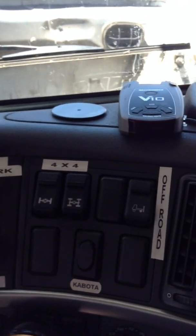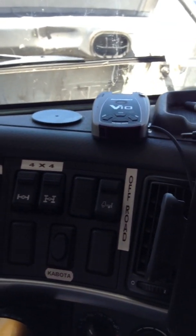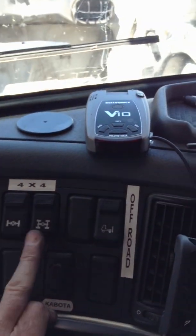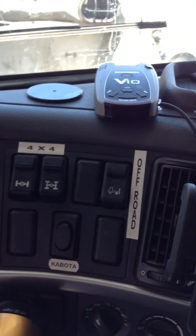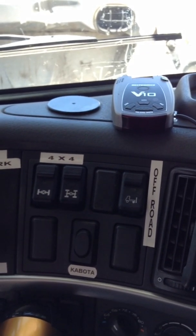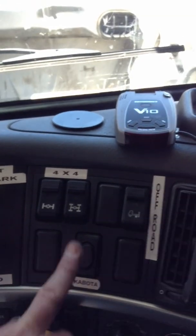This truck is equipped with both a differential lock and full locking rear axle. There's also a bunch of stuff labeled up here on the visor — especially pay attention to how to operate the transmission. The differential lock is a normal differential lock like any class 8 tractor has. You can engage that on the roll. You'll want to slow down to maybe 45 miles an hour and make sure that you absolutely are not spinning when you engage that.